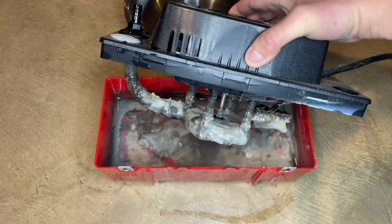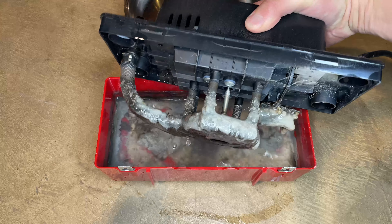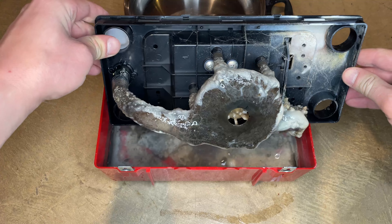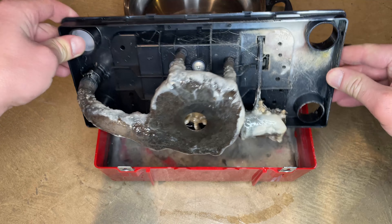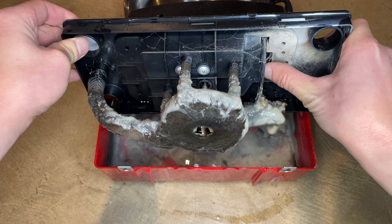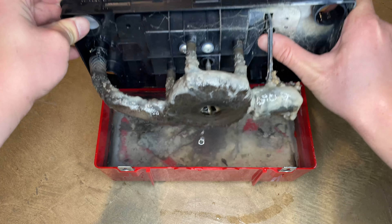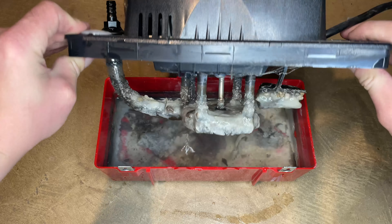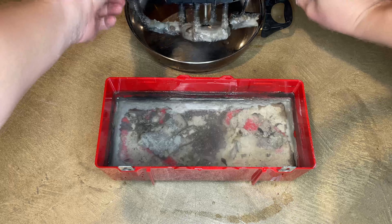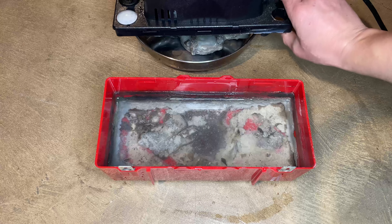The amount of slime in here is quite something. The tray is filled and the floater is completely covered. This causes the pump to not turn on and therefore overflow, but luckily on a basement floor. While a basement floor can handle such things, this is no joke for a furnace installed in an attic. The amount of damage a malfunctioning condensate pump can do is substantial.